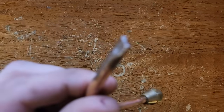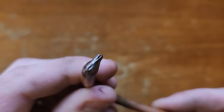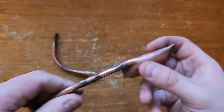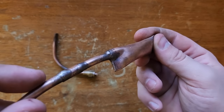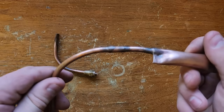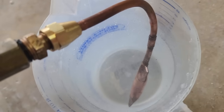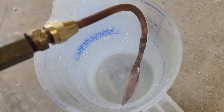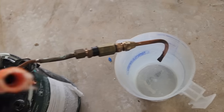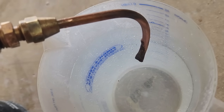Let's get to the build. A lot of people in the comments on my last video pointed out that a real refrigeration system is brazed rather than soldered, so I got a more powerful torch and tried my hand at a few brazing joints. They don't look pretty, but let's see if they hold pressure. An easy way to test this is just to hook it up to a fridge compressor with a flare fitting and dunk the joint in water. This compressor tops out around 500 psi, so if there's any leak, we'll definitely see it bubbling at that pressure. I didn't see any bubbles though.